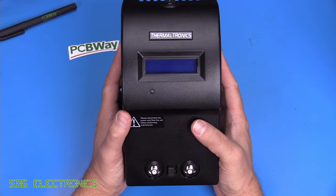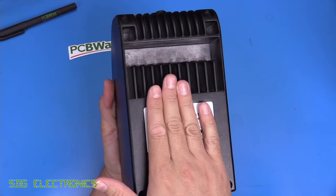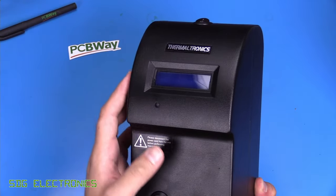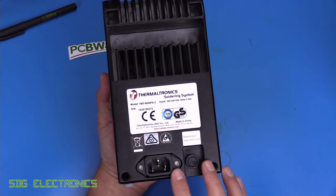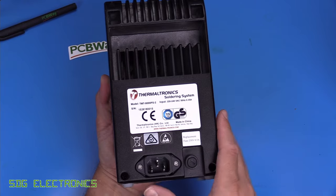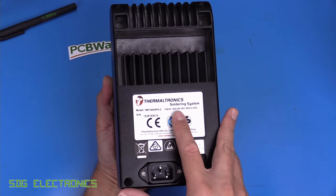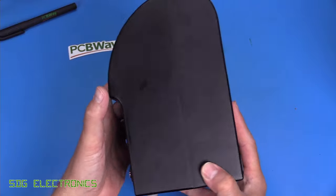Here is the power supply — it's very heavy, so there is a proper transformer in here. The whole thing feels quite well built and is all made from cast aluminium, though it hasn't been painted particularly well. There's a small 0.5 amp fuse, which points towards it not being a switcher. It's made in China, just like the Metcal, with a single input voltage of 220 to 240V. There is a 110-volt version available as well for those in America.